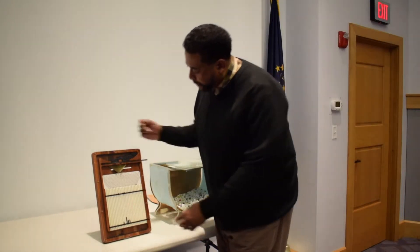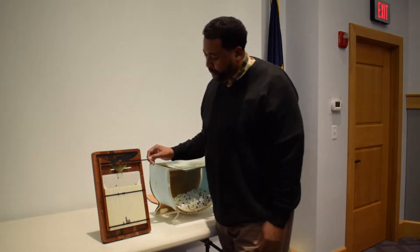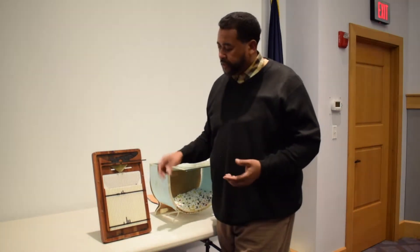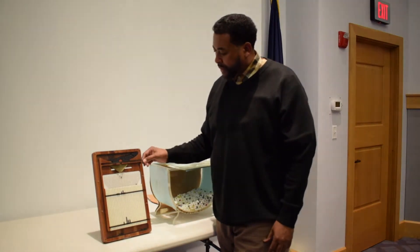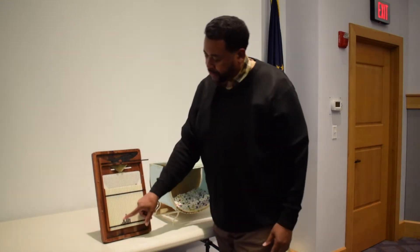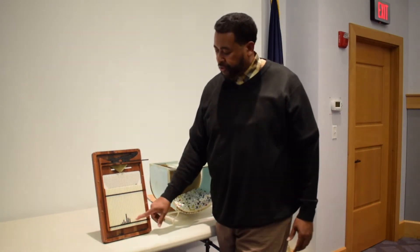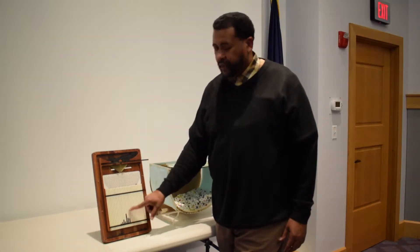Now you're getting pieces over there. Let me move it back — that'll help because now I've got pieces over there. And what you do is when you keep adjusting based on one or two pieces, you maximize variation. But if you just leave it alone and let it run, you'll find out the natural shape. You're going to have a few here, a few there. But the more you adjust it, you'll start getting pieces here and here, and your bell curve will look wide rather than tight.